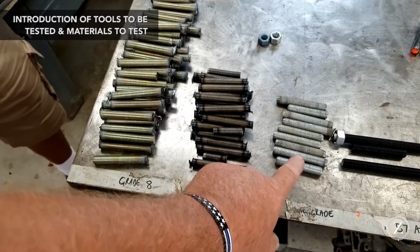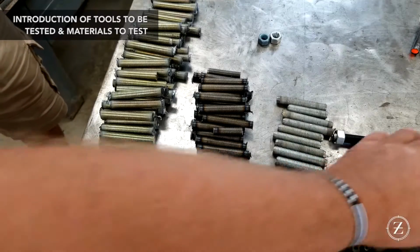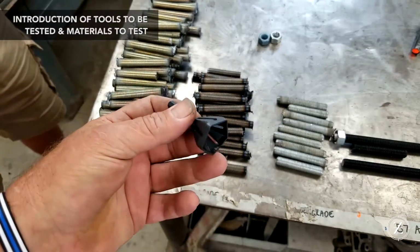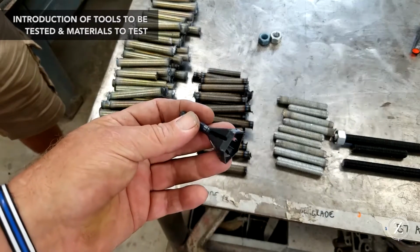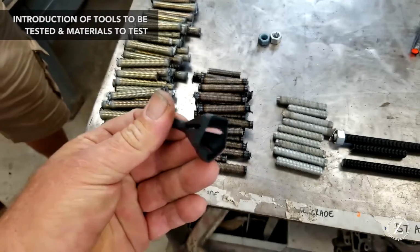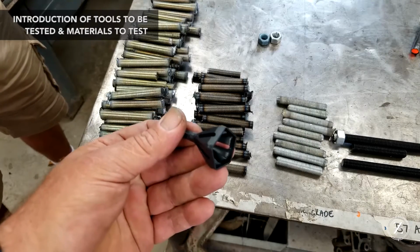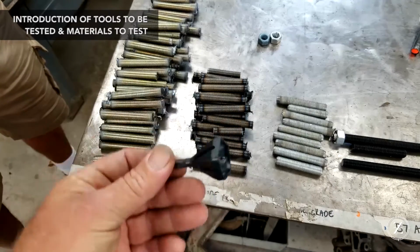Actually, my guys have been using it on 1/2 inch and 3/8 out in the field. I've been using your tool, the Bordeaux, out in the field, and we haven't been able to wear it out all week. The guys have been very pleased with it because they're making portaband cuts. We're using the portaband to cut the all thread, and then cleaning it up with this. We hung over 150 feet of all thread for running racks in the regular course of a day, and we were very pleased with your tool.